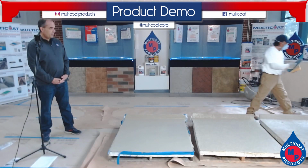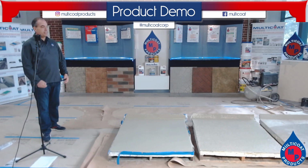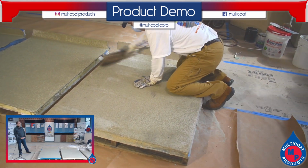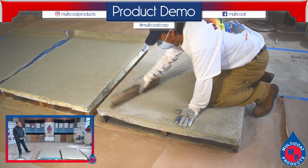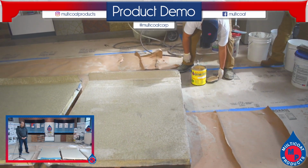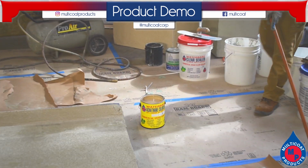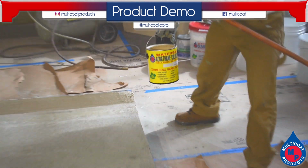Okay, thank you. And then on the last one, we have our textures already cured. We're going to paint it with our color seal. So again, our color seal, we recommend 2 coats. It comes in both a matte, and we also have it available in a gloss base, to give you a little extra protection. And the colors, because they have the integrated sealer, last a long time. I mean, even in extreme temperatures, up to 5 years before maybe you want to start retouching it or just doing another coat, just to make it a deeper color again.